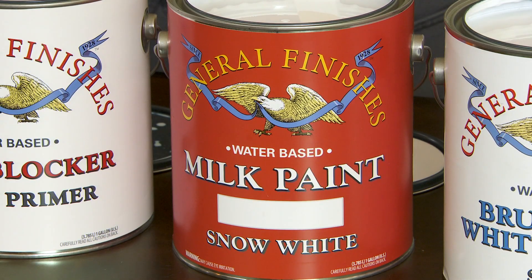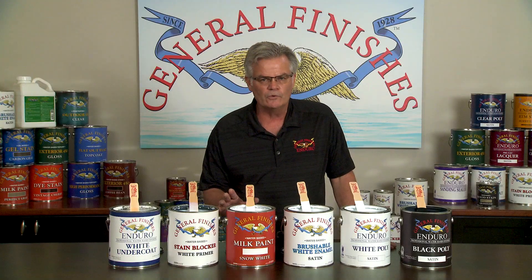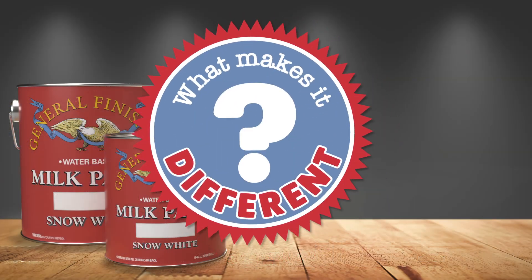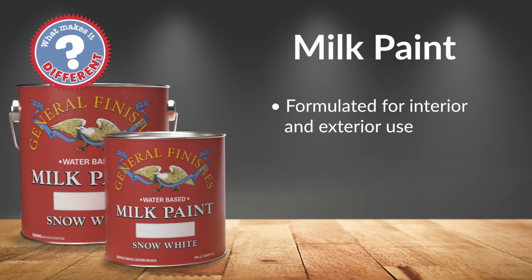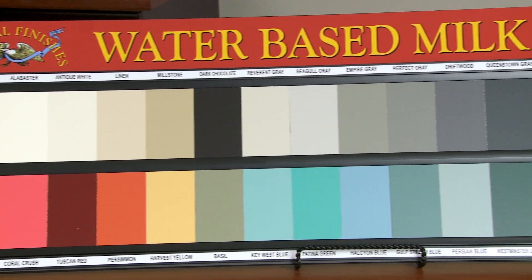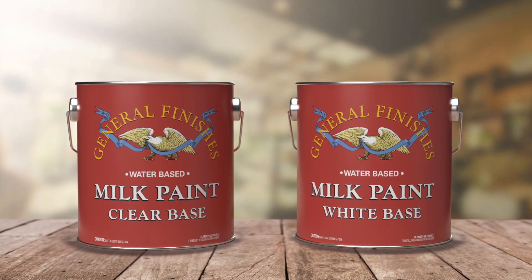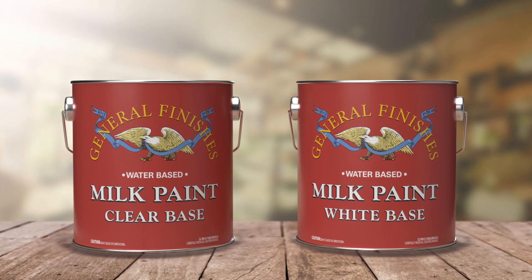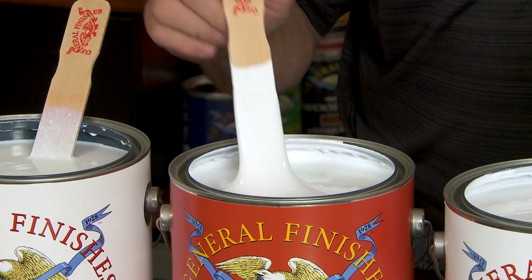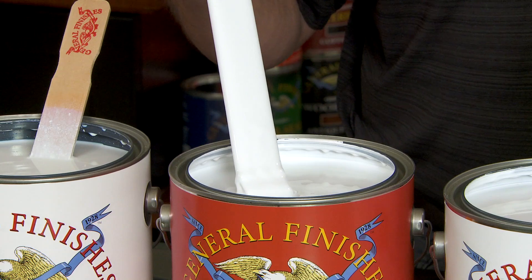Milk Paint. Milk Paint is a pre-mixed, versatile, self-sealing paint designed for furniture, cabinets, and millwork. People love how it flows and levels out to a smooth, professional-looking finish. What makes this different? Milk Paint is formulated for interior and exterior use and can be brushed, sprayed, or rolled. It's available in 33 colors and the line includes tint bases that can be used to create custom colors using most zero VOC water-based colorings. This is General Finishes' original white paint since 2002. Look at how smooth that is.